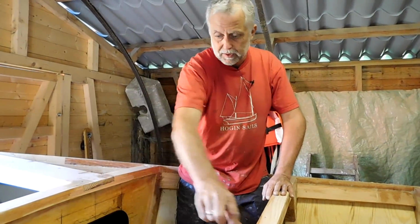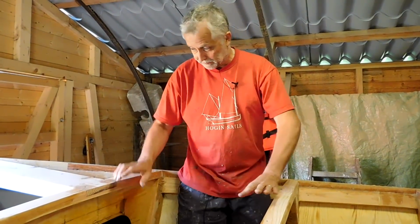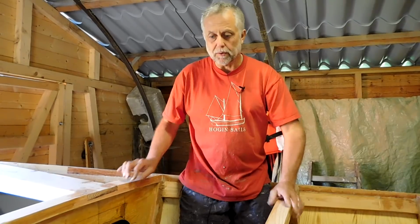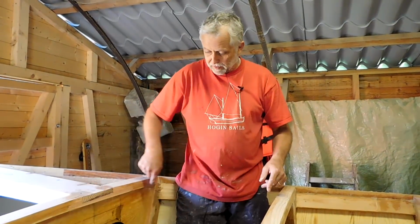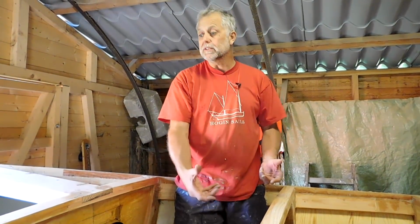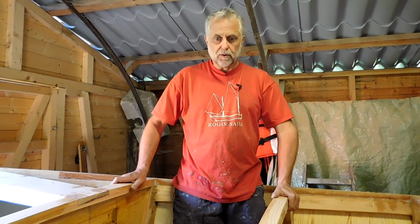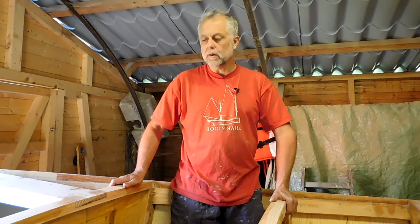So I'll put in a piece of Douglas fir either side, and I'll let in two 10mm thick pieces of plywood in there, so that area of the partners there is 40mm of ply thick with those Douglas fir beams either side. So we're just about to go next door, and I'll cut those.